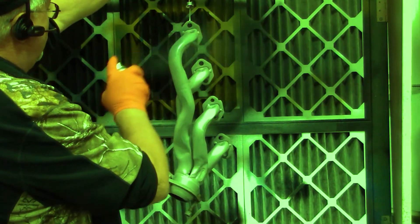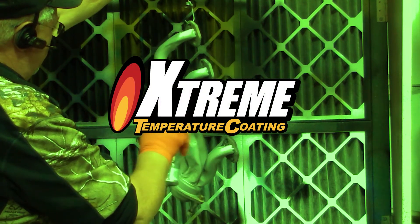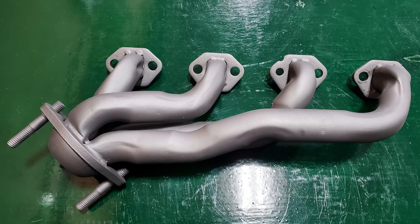This video demonstrates the procedure for the heat curing of XTC extreme temperature coatings. XTC extreme temperature coatings need to be heat cured before high temperature use. After allowing the paint to dry for eight hours, it'll be dry to the touch and can be handled using care. However, the resins in the coating will not reach full hardness until heat cured.